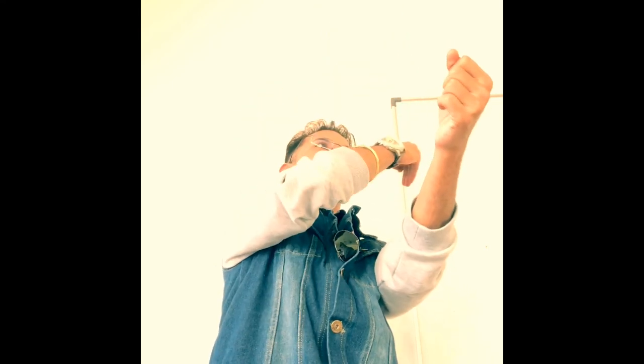If you look at the inside portion of the hammer head, if you break it down, you will find it is made using small balls. The movement of the small ball bearings and the movement of the hammer are in opposite directions, and that's how it will absorb the rebounding effect, and that's how any rebounding can be prevented. If you are swinging like this, the balls in the ball bearing would be moving in the opposite direction. During the impact, again in the opposite direction. So by this, it will take and absorb all the load, thereby preventing any type of rebound action.